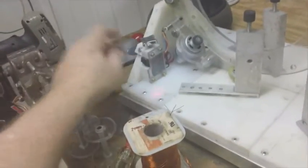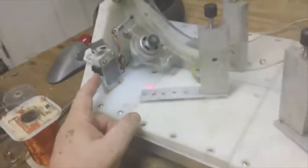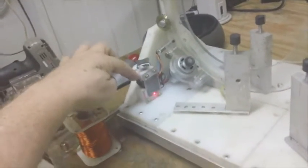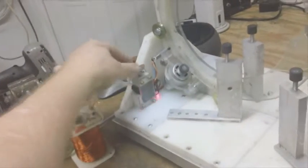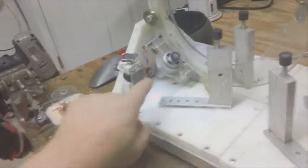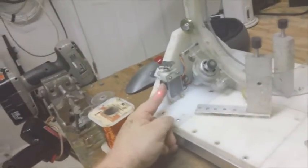One of the things I added to the winding machine — Russ had mentioned it, he put in a foot pedal — but what I did is add a foot pedal with just a micro switch, pushing on the trigger. It's nothing complicated — this is a drill motor and these are the drill guts. By putting this little switch in there, you can turn it and that adjusts the speed of the drill by applying pressure to the trigger. The foot switch just activates it at that speed, so once you've got the speed dialed in you're only stopping and starting with the foot pedal. There's also a reversible switch — by just flipping it I can reverse the direction of the drill.